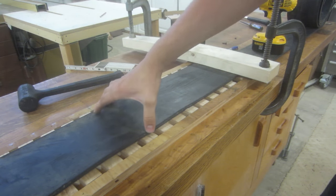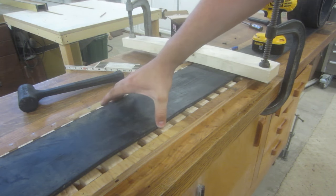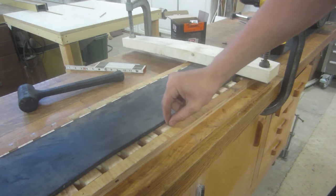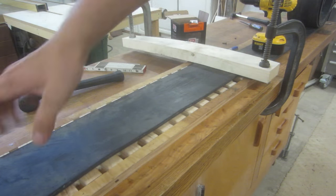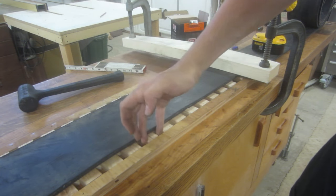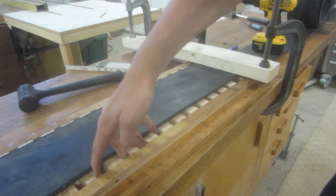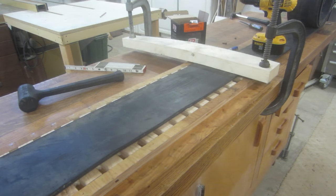This section of conveyor belt is six and a half inches wide. The track pads are eight inches wide, so that leaves three quarters of an inch on each side — because that's where the drive sprocket that's going to drive the track will go. The teeth are going to interlock in there, and that's what'll drive it. You'll see that in my later videos.